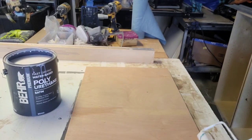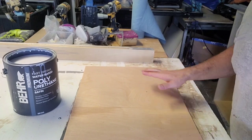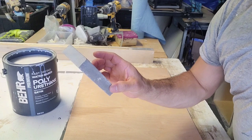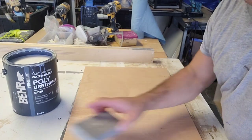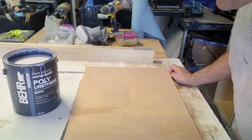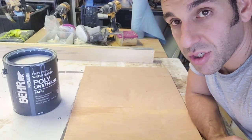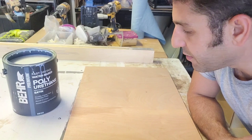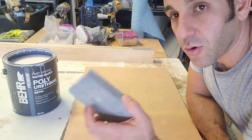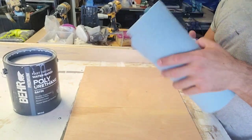I'll show you the finished coat here — so that's two coats. I put one coat on earlier. In between coats you want to definitely sand it down just very lightly, just enough to get the rough coat off, because that first coat's going to soak in and basically act as your sealer coat on the wood itself. Before that second coat goes on, sand it down just real lightly.